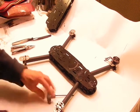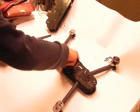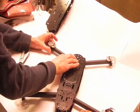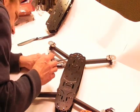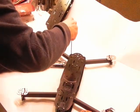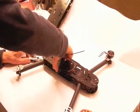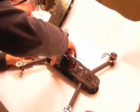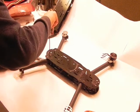And 37. So at 37, we're going to check that our screws on the bottom are laying flush on our flat surface. We're going to put our Leatherman tool underneath, grab our nut here, tighten down this arm without putting too much downward pressure on it. Go to the back arm, doing each one just a little bit each time. Say a full rotation or two when you're getting close to the final tightness of the actual clamp.